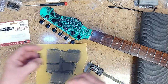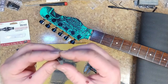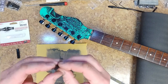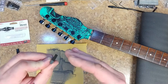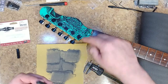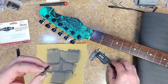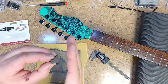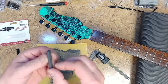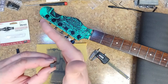The plastic one fits in really nice — it's seated just the way it came out. I want the new one to fit the same way. I don't want to sand the flat side and I don't want to sand the bottom of the nut because that flat bottom gives me a nice square seat. So I'm sanding this side here and using the caliper to get my measurements. I want to achieve a slight curve so it's not so flat — narrow this side and that side down a little bit while adding that curve.